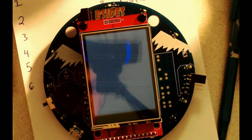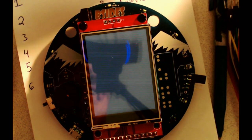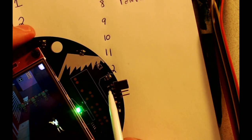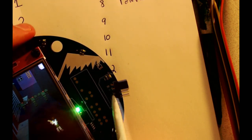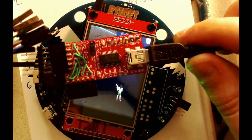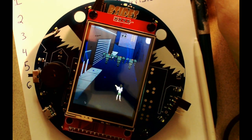One of the cool things we're gonna do is learn a little bit more about this communication. We hacked it, so now we don't have to actually plug into people's badges. If you look at this here, you can't see it again, but this says ground, RX, TX, and ground. If you recognize that, that's usually a serial communication. So we've got basically a UART device here. This is an FTDI chip that lets you do serial communication over USB. And I'm going to show you what the thing actually looks like.